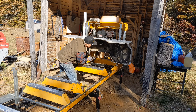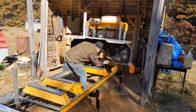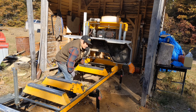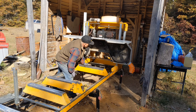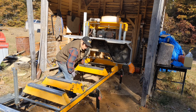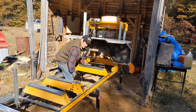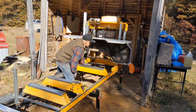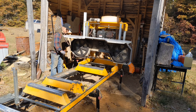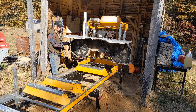Let's get this thing on the sawmill and see how it cuts. A couple of things they mentioned to me: the long life — if I can get 20 logs out of it, that'd be ridiculous. However, they're quite a bit more pricey — about twice the price of a regular blade. These say 'Saber Tooth' on them, so I'm hoping they don't break as easily as the rippers did, because I didn't break too many Saber Tooth. So it's on — let's torque it up the way I always torque my blades. Right there — look where it's at, same place it always is. That's good.